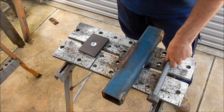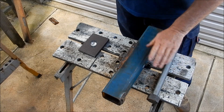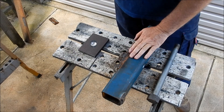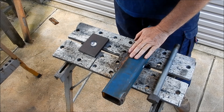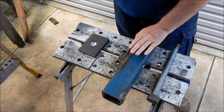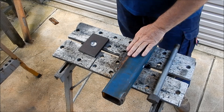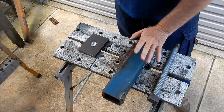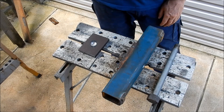I'll just quickly show you what we're up to on these last two piles that I'm going to put these jack supports under. These last two piles are just belts and braces to allow me to pin off the new slab that I'm pouring from my foundry back onto the edge beam of the shed. That shed with unstable ground is going to be taking extra weight of that slab, so that's the reason I put the extra two poles on. I'd rather be safe than sorry.